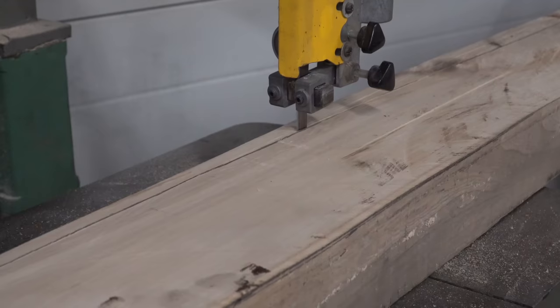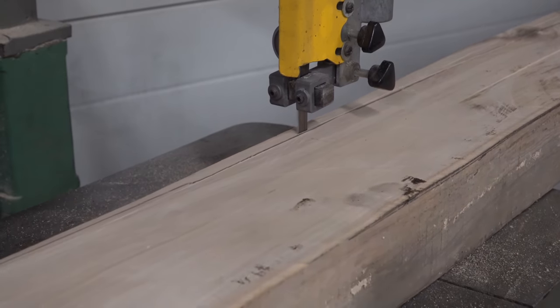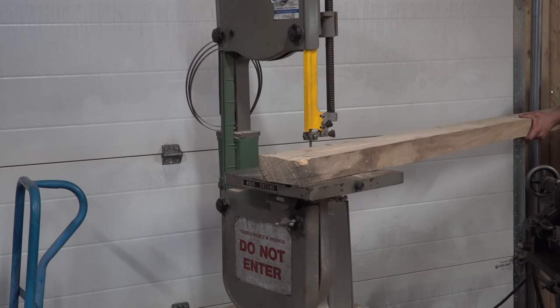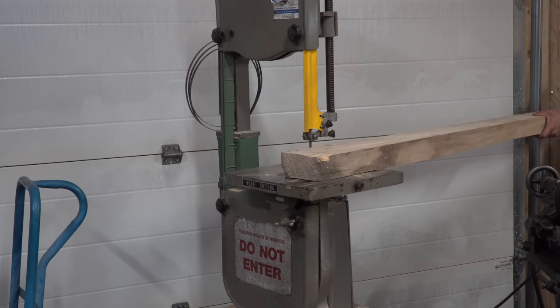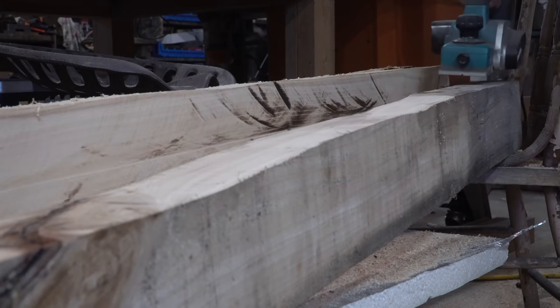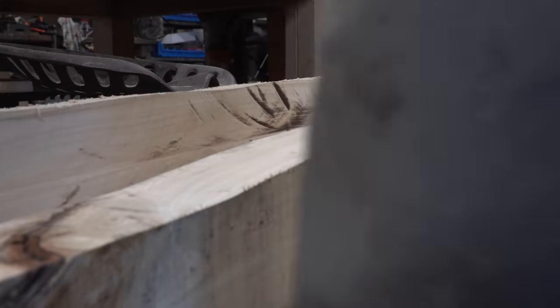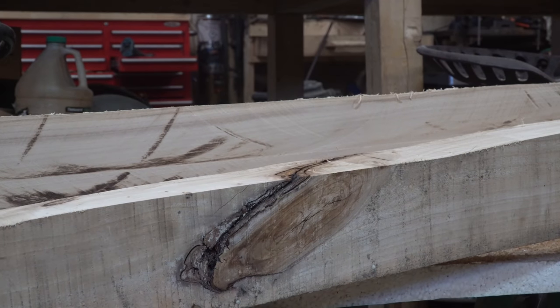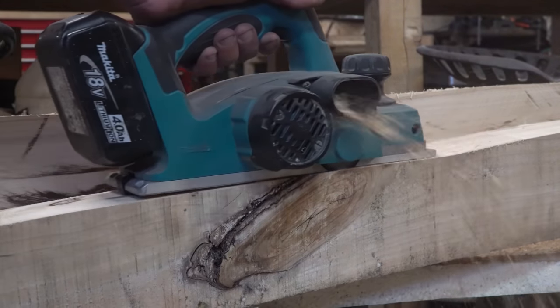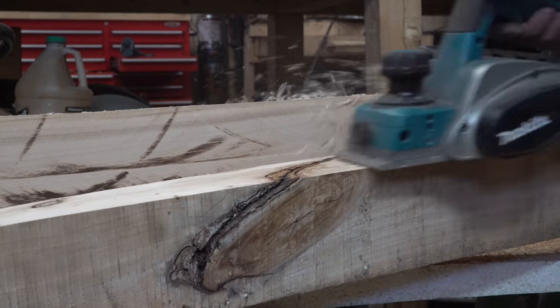So it might add some weight, but it'll definitely keep things a lot more rigid over time. I like to personally try and destroy all my tools to the maximum so that I have to buy new ones — it's really a great idea. I'm going to leave this rough, but not crazy rough. You can see my cut line there is not the greatest, so I'm just going to use the power planer to clean that up so it's nice and flat.